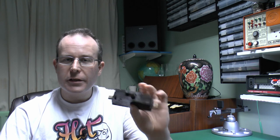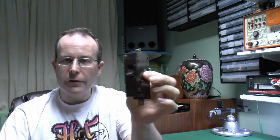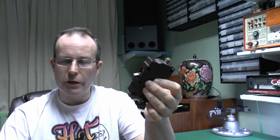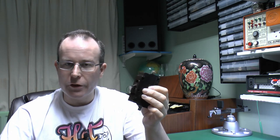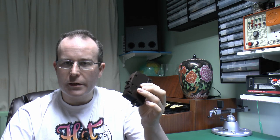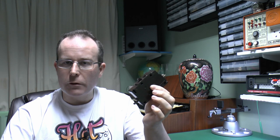Hello, I'm JW and this is a Crabtree C50 circuit breaker. These things are fairly old and I've done a video on the actual consumer units they fit into. Although they're called a C50, they're not a type C and they're not necessarily 50 amps either — C50 is purely the model number. They come in a whole range of different ratings and types. We're going to have a look inside and see how this actually operates, because it's not the same as most other breakers.